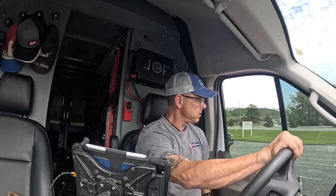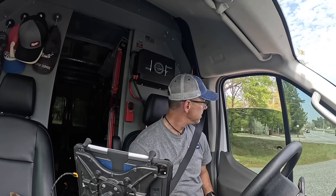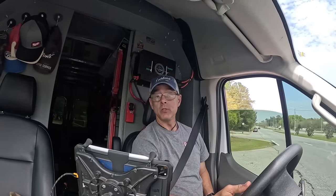Okay, so in the end there, I was never able to get it below 800 microns. And as it turns out, it was because of that Schrader core removal tool. And I gotta tell you, if I didn't say it at the time, I'm not gonna use that one again. In fact, I just picked up a new one. But yeah, so much for that one. I mean, you would think if it has good O-rings in it, the thing's brand new. I've maybe used it twice. And come to think of it, the last time I used it, I had difficulties. I will not use it again.